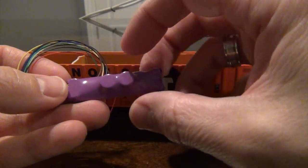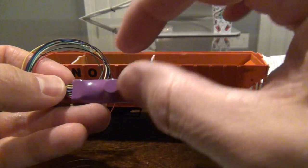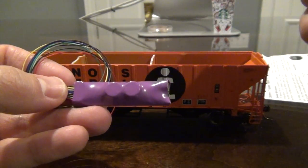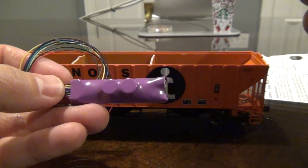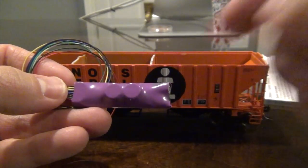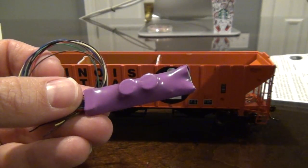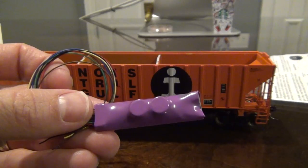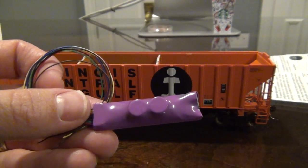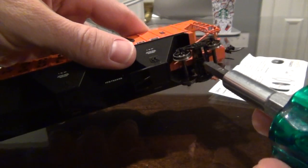On the sound car decoder, there's what's called an intelligent consisting sensor. Basically what this allows you to do is consist this to your locomotive, so when you increase the throttle on your locomotive, this will be consisted with the locomotive, and as the locomotive picks up speed, it's going to change the rate of the sounds that come from the car. This sensor essentially will allow us to consist it to the locomotive without having to go through the entire process of how you would do a multiple unit consist by adding two or three locomotives to the primary locomotive. This has to be in a precise location so that you can activate this sensor with a magnet. Okay, I'm going to go ahead and take the one set of trucks off here.